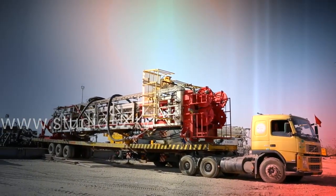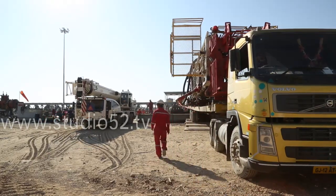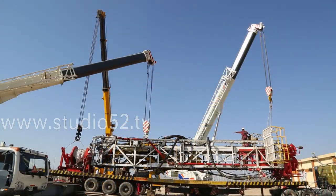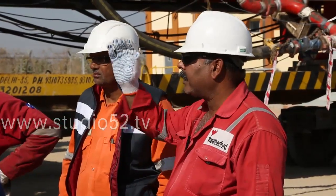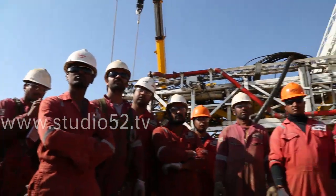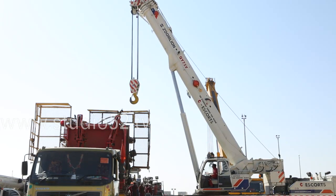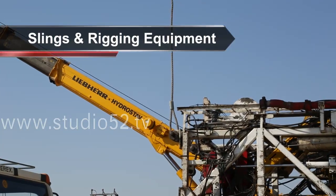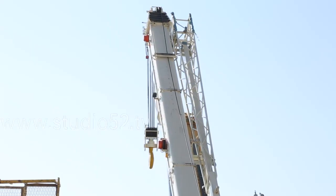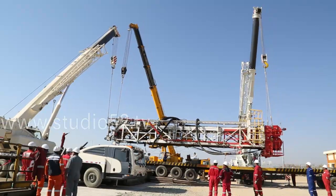In this section of the video, we'll cover the proper handling of masts using cranes. The assembly and disassembly of masts contribute to many hazards in the workplace. Any lift operation using cranes should use caution, but that is doubly true for tandem lifts using two cranes — in such cases, an even higher standard of supervision and attention to detail is required. Ensure that lifting supervisors and tool pushers are present to manage the movements of all loads. The connection of slings and rigging equipment used to attach to the mast can cause structural damage if selection is incorrect. Also watch for the movement of personnel and other vehicles during loading and offloading of masts, and consider wide load distribution and the length of load overhangs.